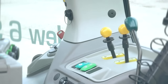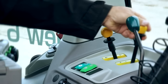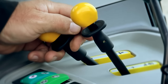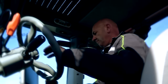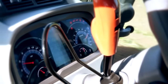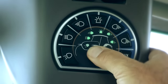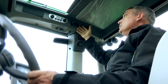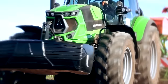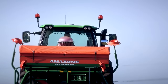All 6 Series come with a four-speed PTO as standard, that is 1000 or 540, in either normal or economy speeds. We have our new InfoCenter Pro with both analogue dials for engine speed and forward speed, and fuel gauges, working light control panel, elements for adjusting the mirrors, and our climate control. We have electrically adjusted and heated rear mirrors, and an option of a heated rear screen.